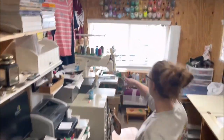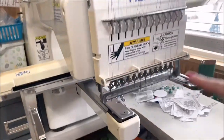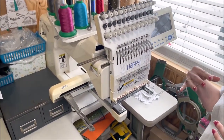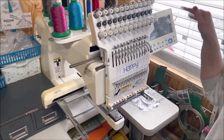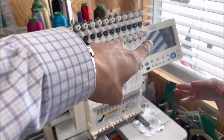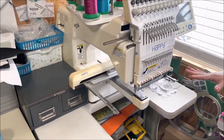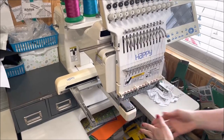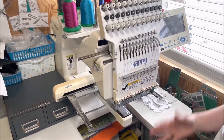This is going to be done on this Happy machine right here. Look at all that. This has 12 different needles, which means I can have 12 different colors at one time without having to change a color mid-design — unless there are more than 12 colors. It's a computer CNC-controlled industrial embroidery machine. There are home tabletop models that can't do larger than a four-by-four and can't handle certain things because of how they're set up, but this is industrial — it can handle heavier materials and do much more.